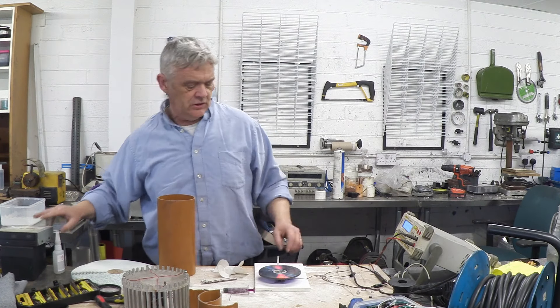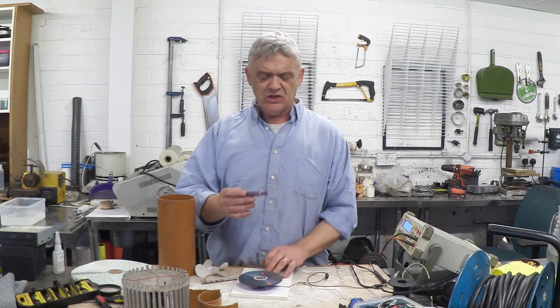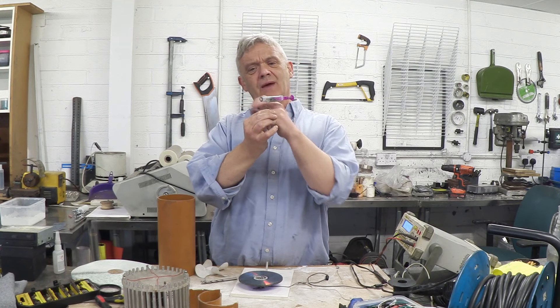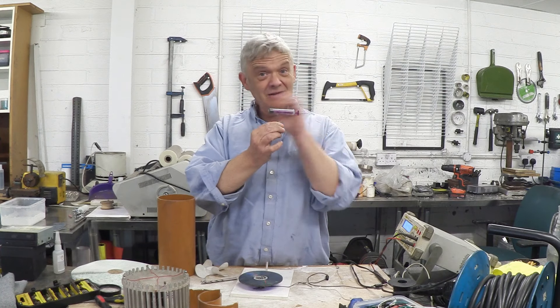Once we'd done that, we mounted it onto a piece of whiteboard — this is builder's board — and added a flywheel. This is just two CDs glued together with a sheet of lead in between. You could glue three CDs together, and then we drove that from this little piston-driven air engine. It's an oscillating engine. When you have the engine like that and blow a stream straight in, it oscillates, moves out of the air stream, and the flywheel keeps it turning so it pushes back out. As it pushes back out it moves back into the air stream, so we don't need a valve — it actually acts as a valve on an oscillating engine, which is why I made it.